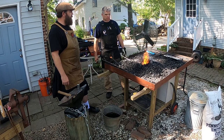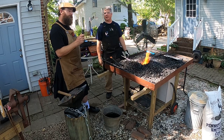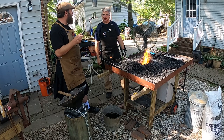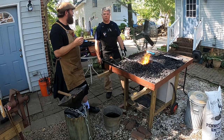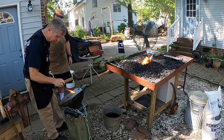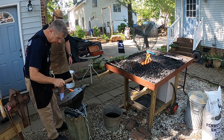All I gotta say is Drew would be very disappointed in you. How was that? Oh, that I hammered cold steel on my hot cutoff. No, that you have your cutoff still in there while you're forging. Yes, that's a big no-no. That will injure you very quickly. Well, it can get in your way for sure. The one habit that Drew tried to break me of, and it took me a while, is to leave your hammer at the anvil. Absolutely. When I was taking my beginner class.